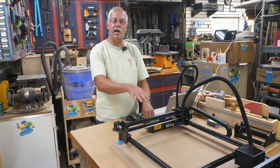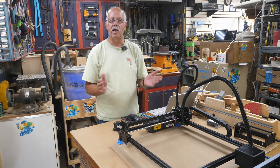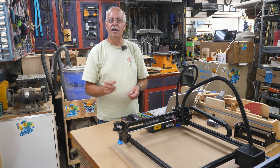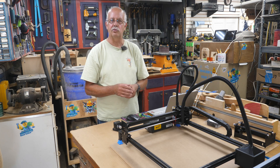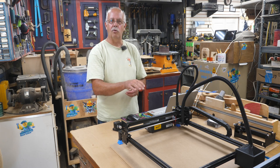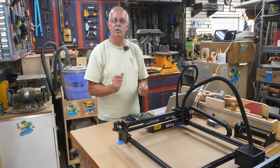Now I need to get this laid out for my grid. I'm going to use a grid file already made by someone from Buster Beagle 3D — he has the file on Thingiverse. It is designed for the Ortur Laser Master 2 Pro, but it happens to be a 400mm square layout grid, and that will work out perfectly here. The G-code can be downloaded from Thingiverse and I'll put a link in the description. I need to frame this and run it from LaserGRBL. You could convert it to run from the touch screen using the MK software to convert the G-code, but I can do it directly from LaserGRBL. It'll make the grid — it's a rather long engrave but it does an excellent job, and if it doesn't come out dark enough the first time you can run it again to darken it up.